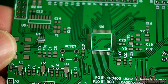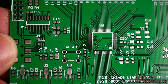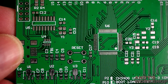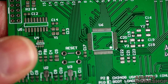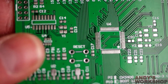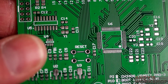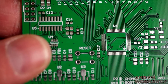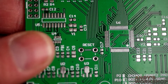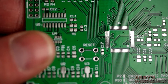Following with the macro lens — yes, I can see even on the preview screen that the solder mask is completely intact between those pins. The depth of field on the macro lens is extremely shallow, so I apologize if it's out of focus. This is really important because I tin the pads, place the components, then reflow in my oven — I need that solder mask intact to prevent bridges between pads. Interestingly, they've seemingly ignored my solder mask expansion rules, which I had set to about 4 mil — which would have left an extremely thin sliver between half-mil pads. But they've kept it all intact, which is better.